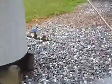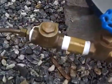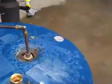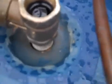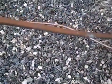Again, the cold water is coming from the bottom. Let me show you that. It's a standard water heater, and I just teed off the cold water from the drain, put in a shut off and a check valve, and then the cold water goes and hits the bottom of the coil, and then it rises up in here. You can hear some gurgling. This thing will burn your hand off. It's so hot. Hear that gurgling? That's hot water going to the top. You can see this thing shake a little bit as it thermosiphons and pumps.